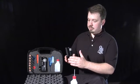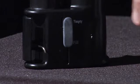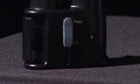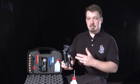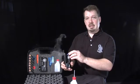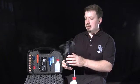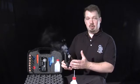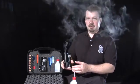The trigger on the Smoke Pencil comes with a trigger lock — there's a very small pin you'll have to remove first so that you can pull the trigger down. Once you have the device ready to use, you pull the trigger and the device will start generating a little bit of smoke. You'll also see that a little LED light comes on top of the Smoke Pencil unit — that LED lets you know that the heating element is engaged. If you need a bigger puff of smoke, you would pull the trigger the rest of the way down, and that generates a larger puff of smoke.